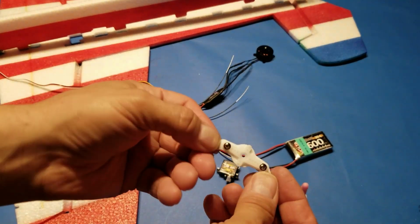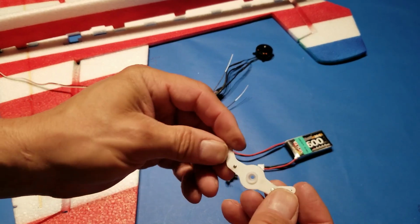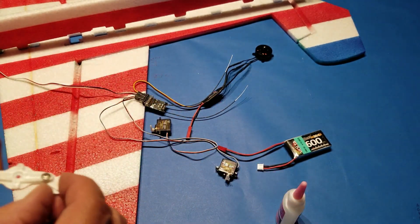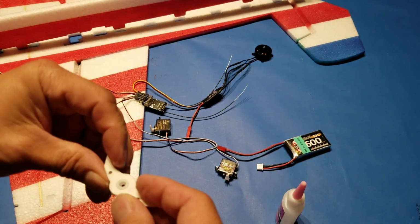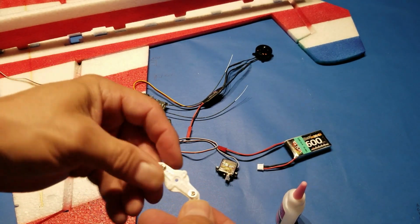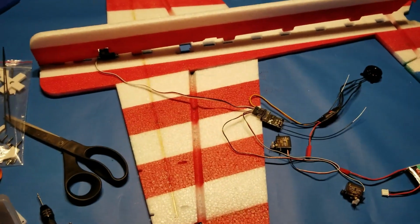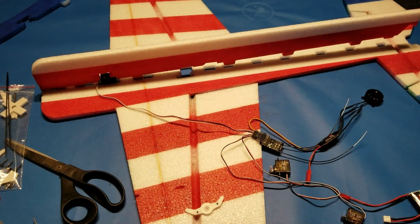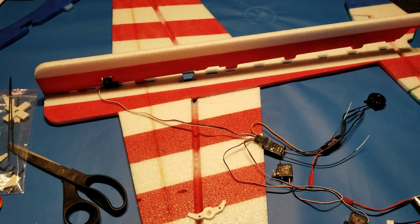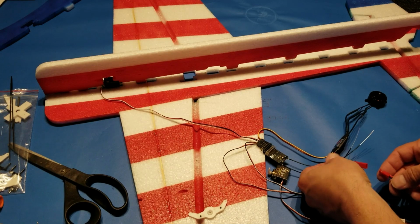All right, so I have my screws in, and what I did is I just took it to a bench grinder and just ground these down flat underneath. So now we are ready to center this on the servo. For that, I need to power the electronics back up and make sure the servo is thoroughly centered before I tighten down and Loctite the screw.